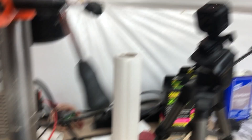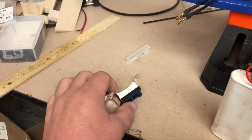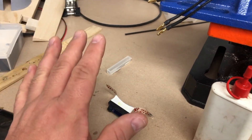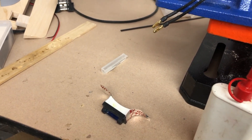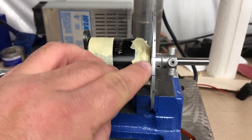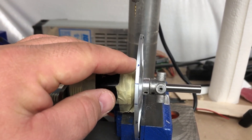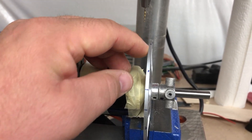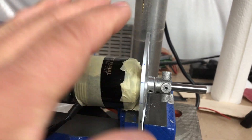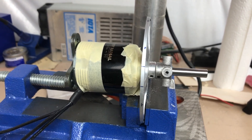So I am going to put on the GoPro and I'll show you how I'm doing this. I've got a little tool here that you'll see how it works just to make things level and as straight as possible. I'm not going for hyper accurate straightness here — just straight enough will do. I've pre-measured everything. I have the spinner on here and this is where the gap is, and I measured the distance between each gap. This distance is 1.6 millimeters, this is 3.2, and then another 1.6 here, and it's the same all the way around. So I won't have to worry about balance or anything — everything is going to be perfectly measured out and even. So with that, I'm going to shut up and I'm going to get drilling.